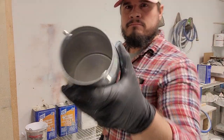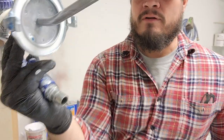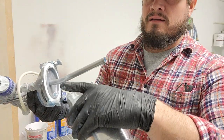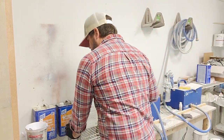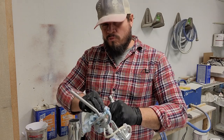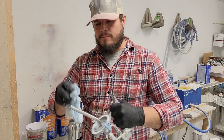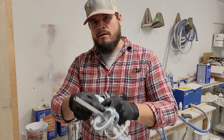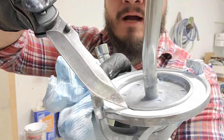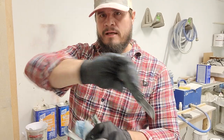You want to open the gun back up and you can see that's a pretty clean cup — it was so pressurized you can see a little smoke coming out, which is pretty cool. My pickup tube is clean, my gasket is pretty clean. You can take lacquer thinner and clean around that gasket, or you can take the gasket out — whichever way you want. It's a disposable product and we keep plenty on hand. If you do remove the gasket, cut it from the inside lip — not the outside — because if you damage the outside, it'll leak paint all over your project.